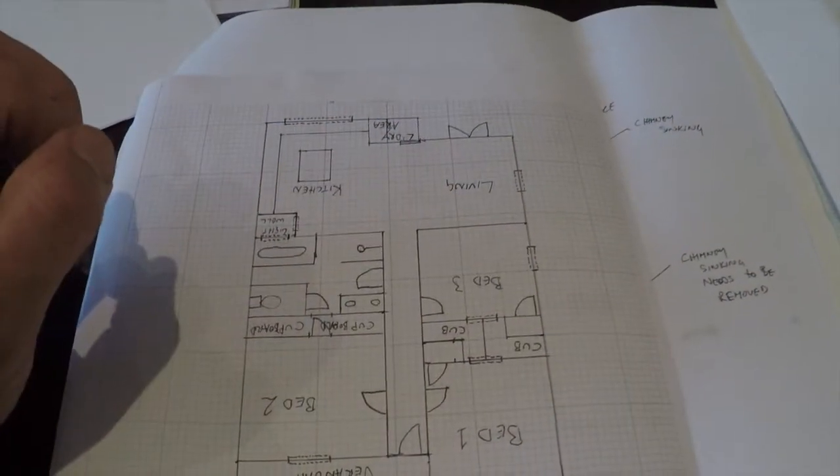That's basically the design the owners and I have finalized. What we're going to do now is forward that over to town planning. Anything we do on the external walls of a house we need to make sure we go to town planning — chimneys that get pulled down, windows that we change, anything like that has to go to council for permission. Then we can take it from there to get our building permits, insurances, and all of that sorted. If you've got any questions please forward them via email and I'll get to them as quickly as I can. Till then, stay awesome and I'll hopefully see you soon. Bye bye.